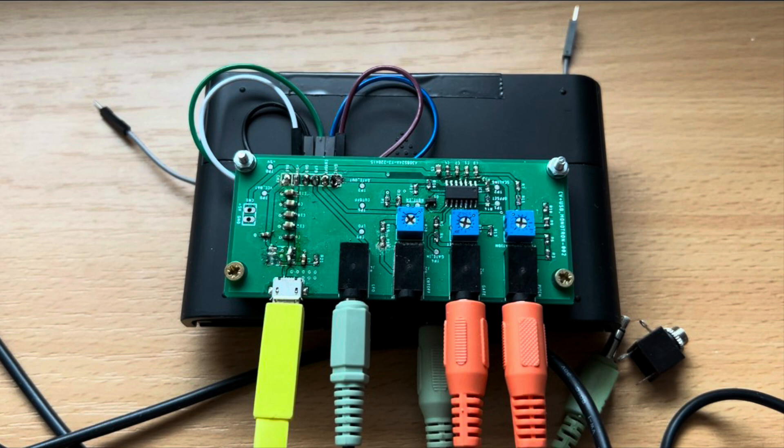Furthermore, most of the op-amps inside the Monotron use a bias voltage of 1.35V as a negative reference instead of ground, so the pitch CV needs to start at this amount as well. C0 starts at this value — 1.35V or something like that.